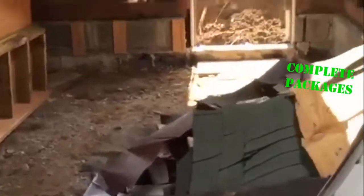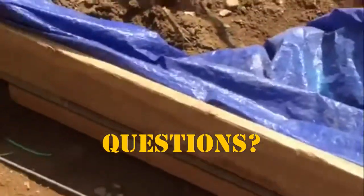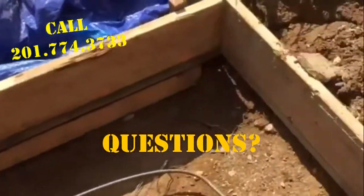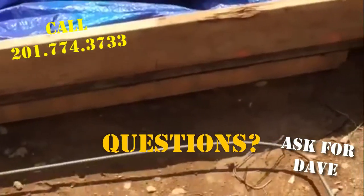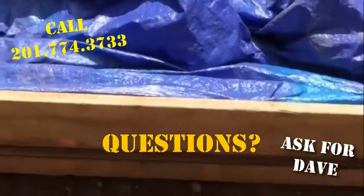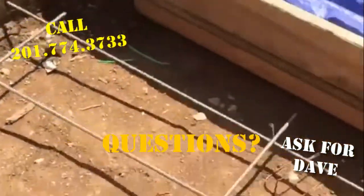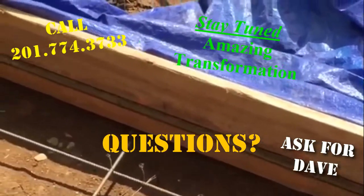Now we have another footing in the back here, which behind the garage we're going to be squaring off. You see our rebar is pinned into the wall, rebar ground wire, and it originally called for just a box going across and then coming back to this end here, but what we want to do is fill in the whole thing with concrete, make it more secure. It will block in the footing of the original garage, which you can see down there, so it's a nicer configuration and more strong.